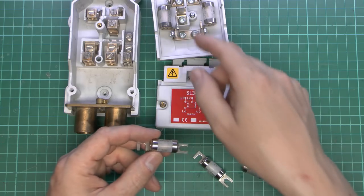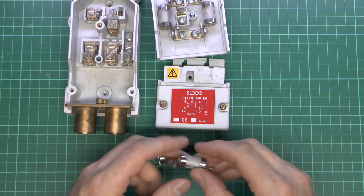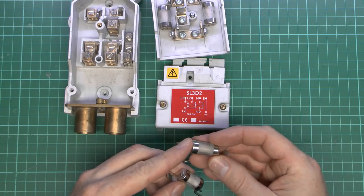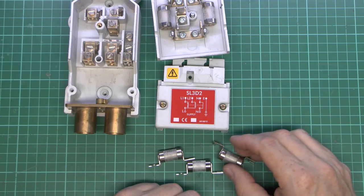The fuse ratings are a 6 and a 20 in there, and I've got a 32 here as well — I think that actually is all 32s available. You just select the fuse depending on what's connected to the other side. So that's a street lighting cutout, designed specifically for that purpose, although there's no reason you couldn't use it for something else if you needed a couple of fuses at a moderately low rating — up to around 30 amps or so. These are still available in various forms; newer ones are sold under the Eaton brand now, and obviously other manufacturers are available. So that's it for this time — thanks for watching.